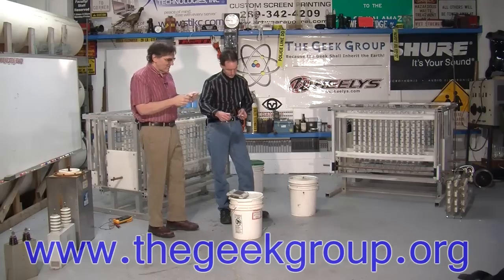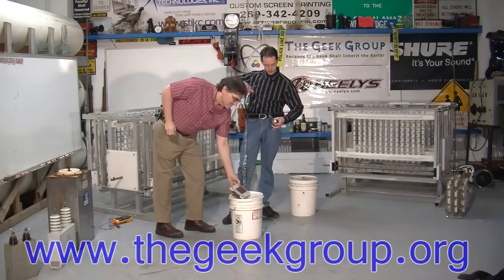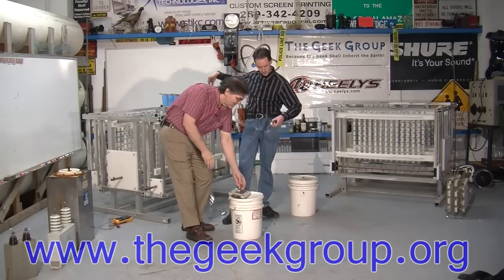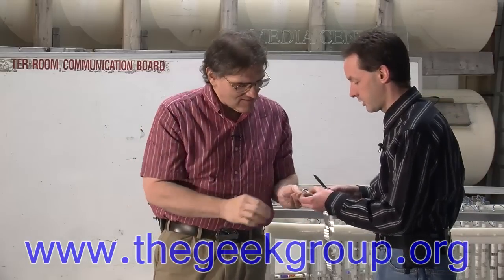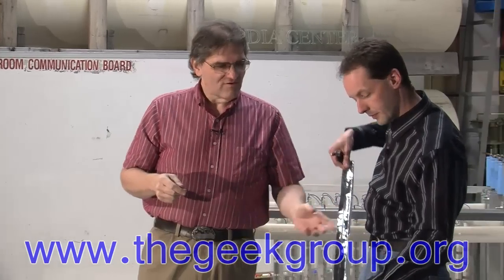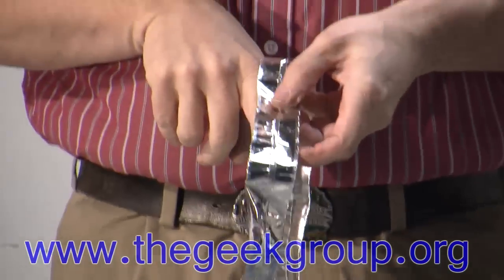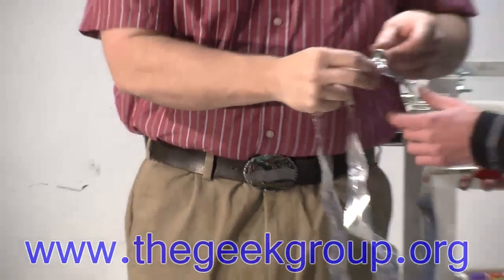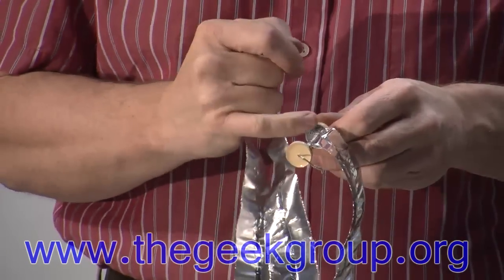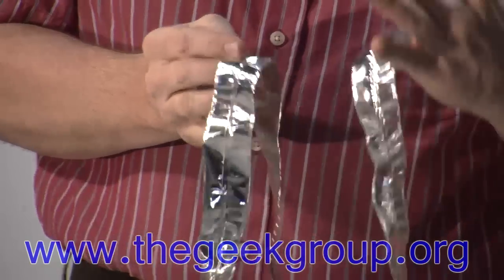Now, what makes this a pulse cap, which is also something you want for a Tesla coil, is that like this cap, where you have your interleaved plates, on this one they don't go all the way. I was going down far enough so you could show the connections. On this one, the interleaving is from end to end. So one of your plates stretches out far on this side, the other plate stretches out far on this side, and you can show that the whole end is connected. And then, if you look here, see if I can get the lighting right, this is all metal here. Basically, the entire spiraled end is connected, and then on the other side, connected here.